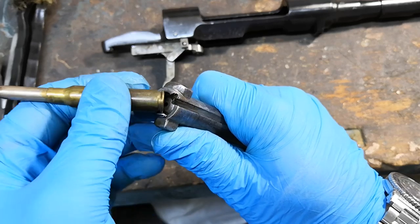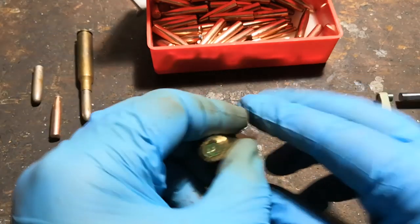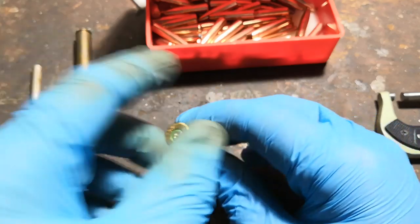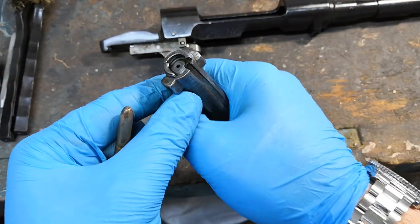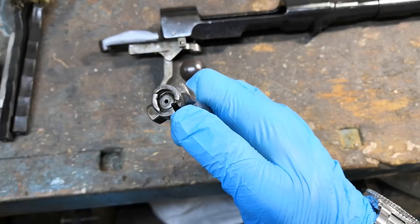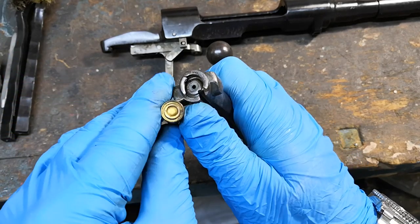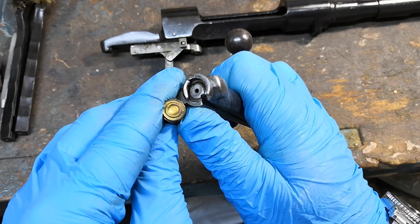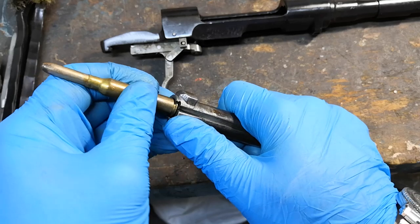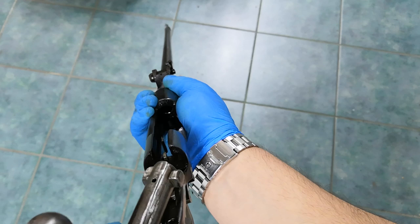I don't know if this expedient was really necessary. What is sure is that contemporary ammunition no longer has the groove on the case head, but this shouldn't interfere too much in the phenomenon, since the depression in the bolt head is enough by itself to increase the contact pressure. On the other hand, the gas vent grooving the bolt also causes the presence of a weak spot in the case head, and in case of overpressures this is generally where the system fails first. The case head ruptures and pieces of brass are shot backwards — that only happens if maximum pressure is exceeded. In today's engineering we would just say that this design is not fail safe. Anyway, have a look at this hole — do you know what this is for? Let me know in the comments.